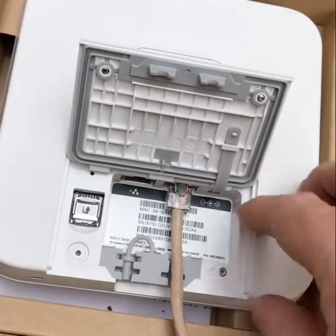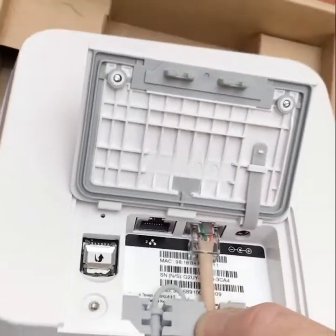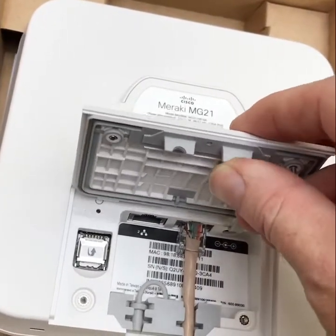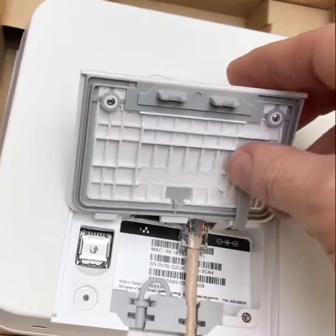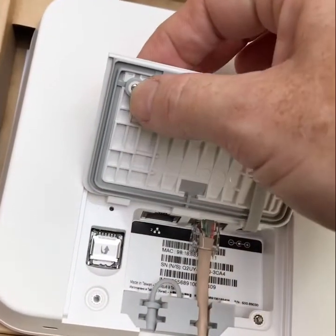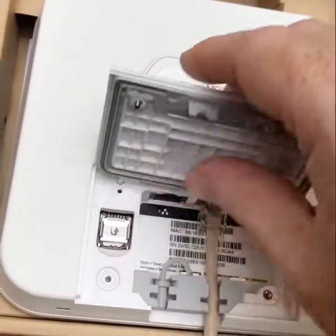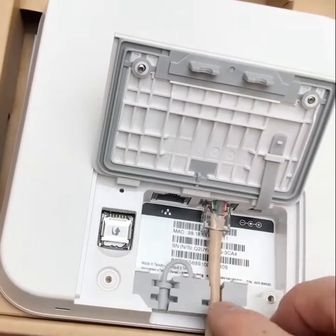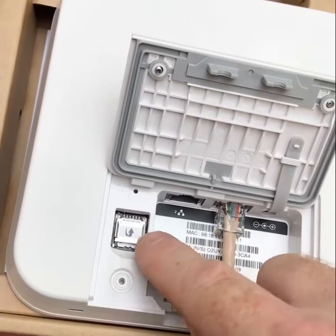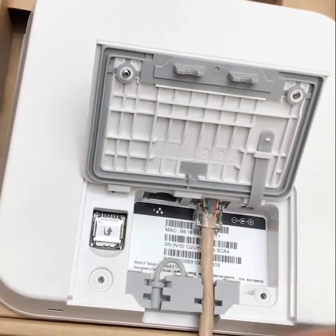Doing a quick check here — I've got the MG21 and the Ethernet cable run up from the basement. You want to make sure you push this in here for a nice watertight seal with the gasket. When you close this, you can see the other part of the rubber will push down onto the cable and make a nice seal. Make sure that the gasket stays flat when you reinstall it, and tighten the screws — not too tight, but just nice and snug to make a watertight seal. So we've got the Ethernet cable with the end crimped on it, plugged into the PoE port, and the SIM card ready to go. We're just going to seal this up and put it on the side of the house, then start working on the wiring down in the basement.